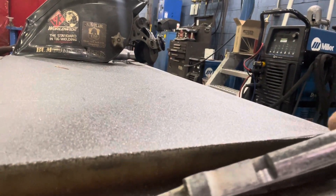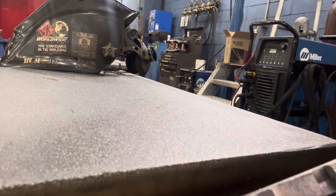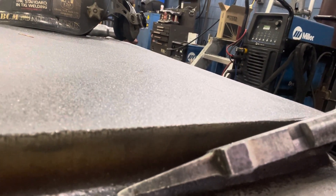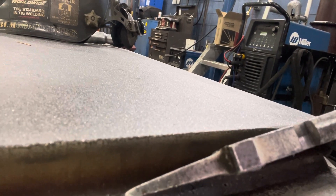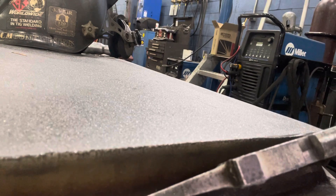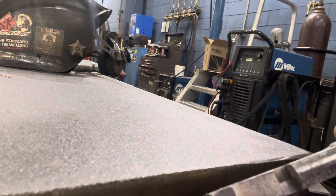We're going to go right on the bottom here and cut this in half — half on the base material and come halfway up this bead. You want to try to leave a little tiny hump right on the top so when we do the top bead it'll just fill in like a regular fillet. So we'll do the bottom bead now.